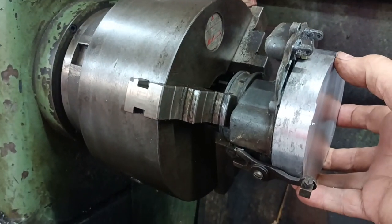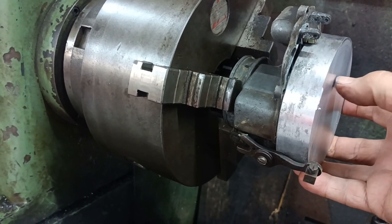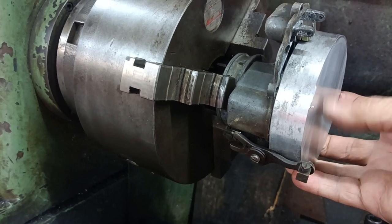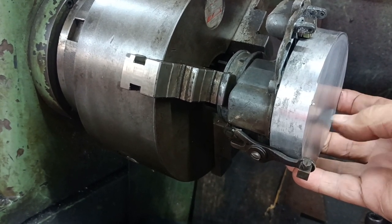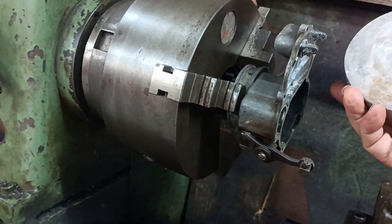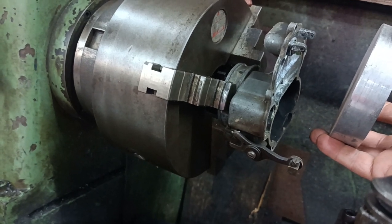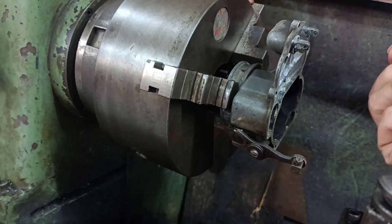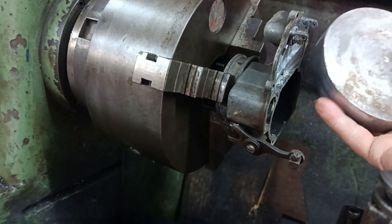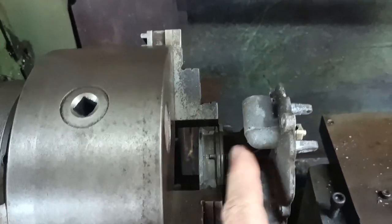and then what I'll do, I'll face off this end down to leaving a round bit there, and then I will turn this round and hold the round bit in the chuck, and then I can screw other carb tops on and machine this part,